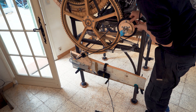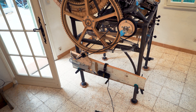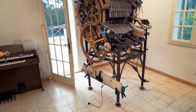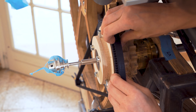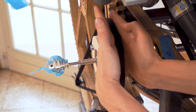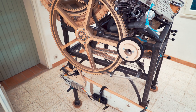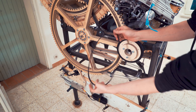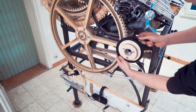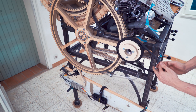The belt was eating its way into the gear. Apart from that, a successful first try. I have to understand more about how the motor works, but this was amazing. The only issue was that the belt was climbing to the side and starting to fall off the pulley. I was going to build two flanges to keep the belt on, but the new belt just arrived and it's much shorter, so I'm gonna move the motor up here. With this shorter belt we may not need any flanges, so I can skip that step.